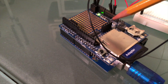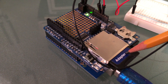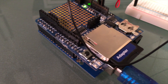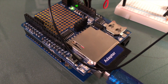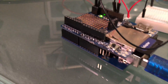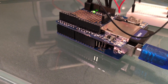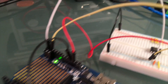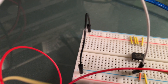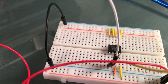Okay, so this is the circuit I'm gonna use. This is a data logging shield made by Adafruit — I did a previous video on this covering reading and writing temperature values and datetime stamps to the SD card. It uses SPI protocol and just plugs into the Arduino underneath it. And this is the EEPROM chip — it's 64k — and I've also done a previous video on this.